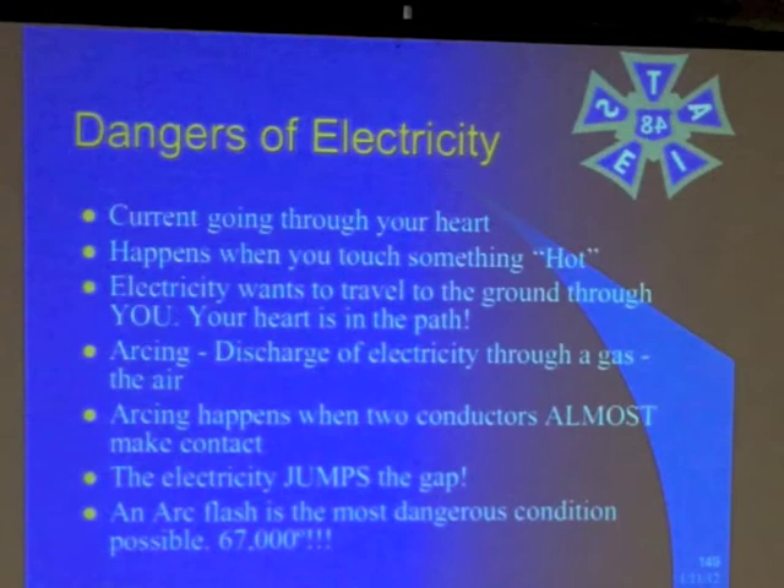How far will arc flash jump? About four feet — it's like a four-foot cloud. I've seen videos of arc flashes. It only lasts a fraction of a second but it's 67,000 degrees, and it kills people. Every year, a few people nationwide get killed by arc flashes. That's why when you're working on the feeder and there's a gap around the service panel, technically a licensed electrician is the only one that should be working within that radius. That's the way the code is written.